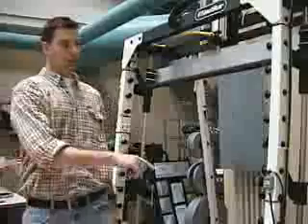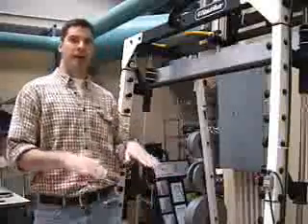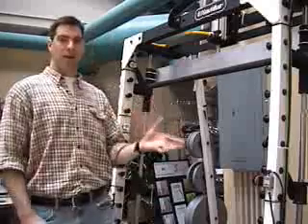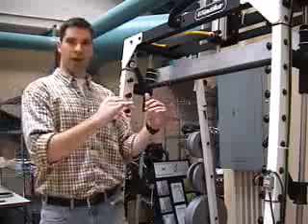The isometric test shows that the force a person can exert changes throughout the range of the lift, so the goal is to change the resistance based on how strong the person is at each point. This is done by monitoring velocity — if velocity goes above the set point, resistance increases interactively. The graph shows that during the negative portion of the lift the resistance stays constant, but as soon as velocity changes from negative to positive, the machine starts adjusting resistance based on speed. The resistance increased from about 170 up to 213 as the person's velocity exceeded the set point.